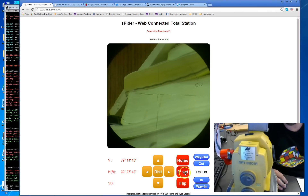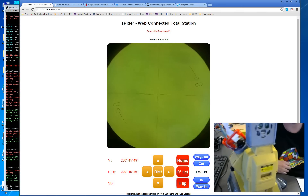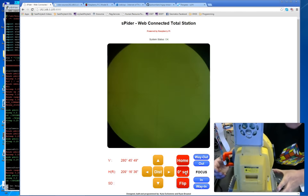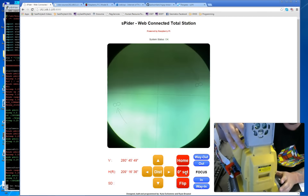We've also seen home and zero-set — and then there's 'flip,' which transits the instrument. You'll notice that the image is now inverted when in face two. When we were using Raspistill we could programmatically overcome this, but right now I'm working on a better solution. So currently images will be inverted in face two, but that will be changing soon.